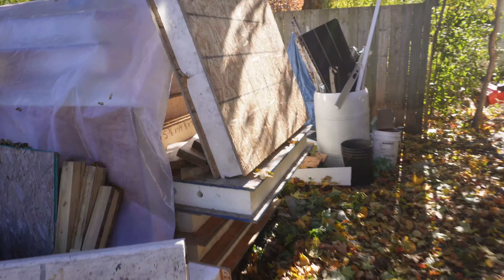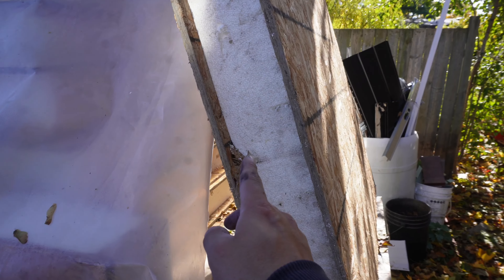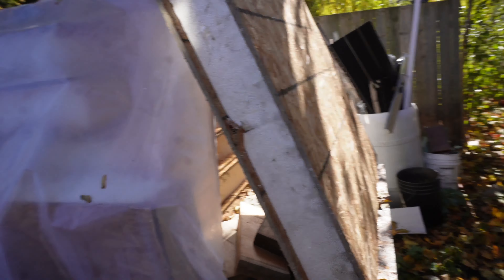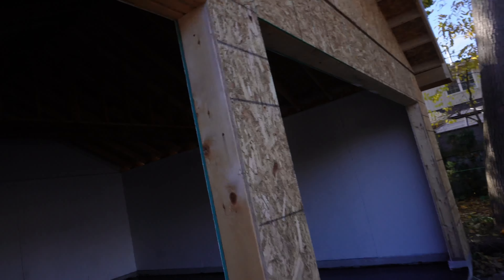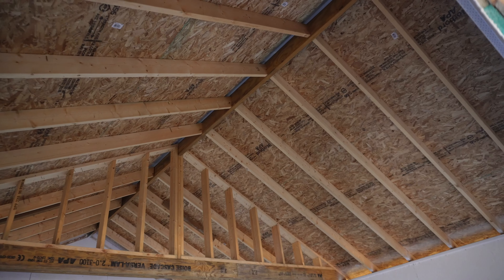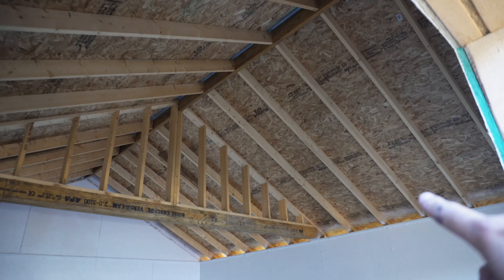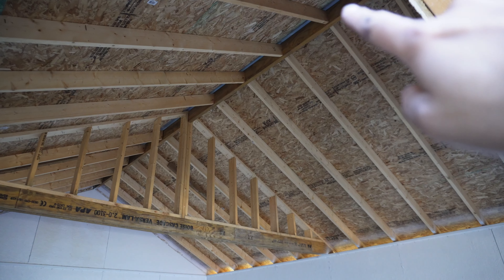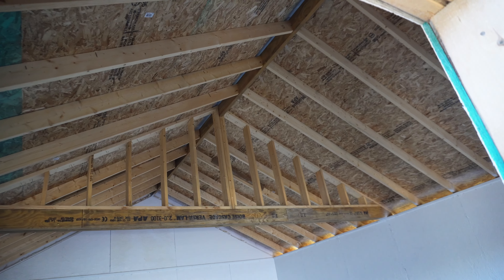We're debating — since we got such a good deal on these and it's actually cheaper than regular insulation — maybe doing the same thing on the ceiling. If I slice these panels right down the middle I get two pieces out of each, and we can cut them to fit all the joist bays and get insulation in the ceiling as well. If I cut those SIP panels to fit inside the joist bays but leave an airspace at the sheathing, it'll vent up from the soffit to the ridge cap, and there'll be a thermal break so there's no sweating on the roof.